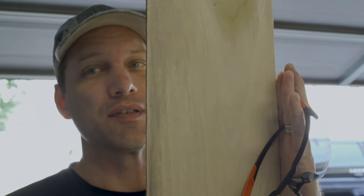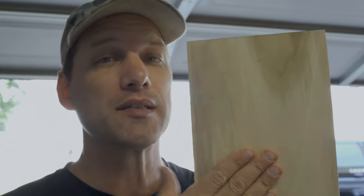If I'm gonna build it, I might as well build it to the 6 inches off the wall I was considering to begin with. That might be a little bit far off the wall. I mean, this is 6.5 inches. That's sticking out pretty far. That means it'll be plenty functional on the inside, lots of room. And the way I see it, I rip this down to 6 inches, build the frame, dry fit it. If I'm not happy, if it's gonna stick out too far, rip another inch off. So I'm gonna rip down this poplar at 7/8 inches down to 6 inch width.